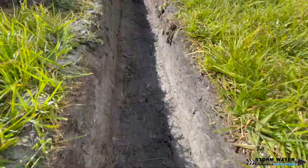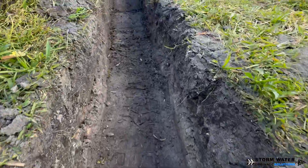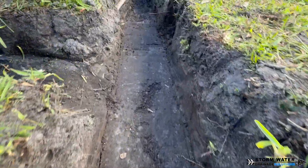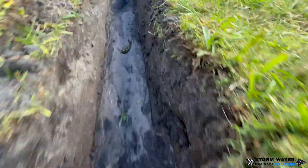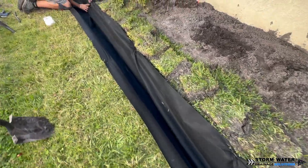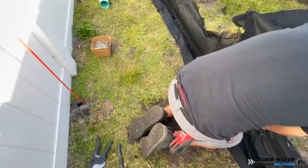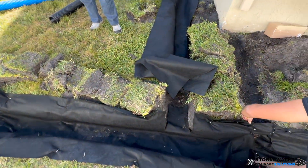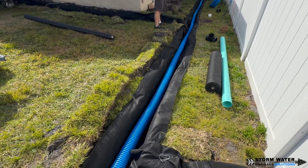As you can see, this soil is actually sand — it's a mixture of sand and peat, so it's loamy soil and it absorbs water pretty well. The problem is there's a depression in this area, it's a low point, so all the water wants to travel there. And there is a clay pan underneath, which is holding the water in the area. So the French drain will dry this up. On this particular job site, water is only accumulating here from that downspout and from the neighbor in the back and the neighbor on the side.